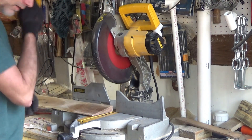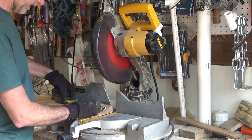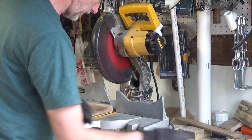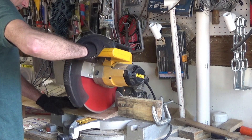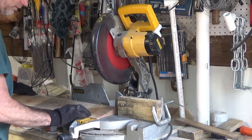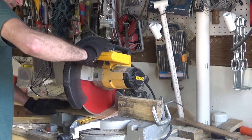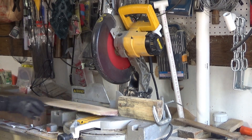I'm probably going to put a stopper on here — this is an old secondhand tool I got. I think I'm going to go to two and a half inches on these. I've got a bunch of them so I'm going to put some kind of a stopper — I'm going to clamp a block on here to make consistent cuts.